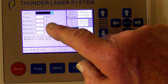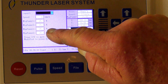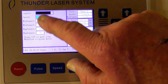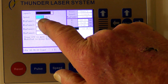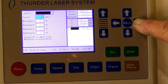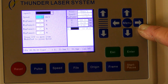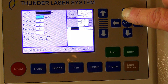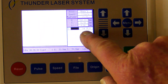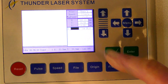I'm going to leave the power as it is and change the speed. Press Menu and it brings you down — when it's highlighted blue you can change it. Bring the little cursor over by pressing the arrow button, then the up button: 13, 14, press Enter. Enter, and it's changed to 14mm a second at 25% power. So we'll run that.